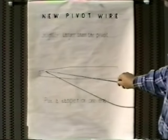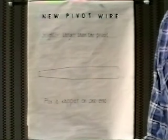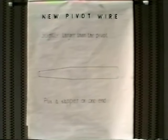I'd like you to put a little taper on the end of the pivot so it'll give us some sort of a pilot when we line it up with the hole that we're going to drill in the arbor.